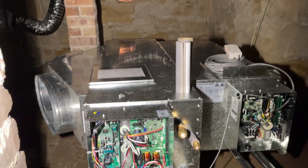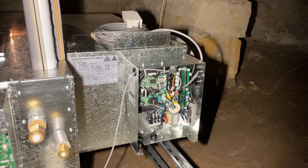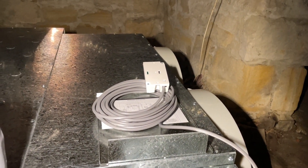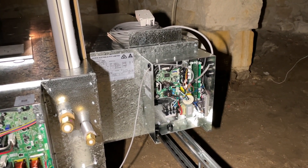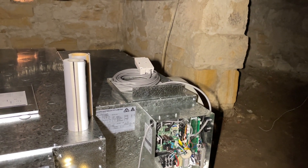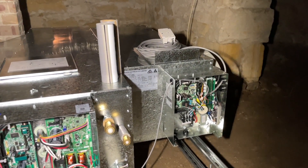Just like any other unit, you have the main box off the side of the fan coil — that's normal. If you get the zone controller you normally get this little extra box that you mount to the side. It's the exact same with the air hub. Basically you've got to run that thing up into the living space — we're going to hide it in the linen cupboard, and it'll just pair to the sensors. You just put the extra box on like you would with the zone controller, and there are plugs on the side that all the zone motors go to. We're going to have that little white box in the linen cupboard with the WiFi module. It looks chaotic when you do the first one, but it's actually very easy.